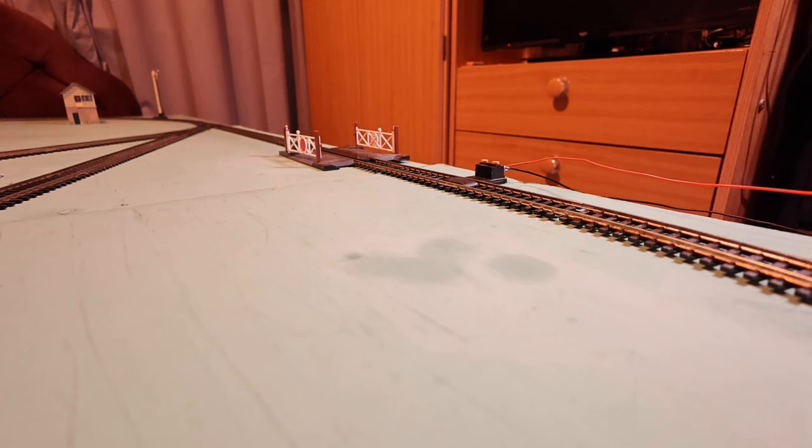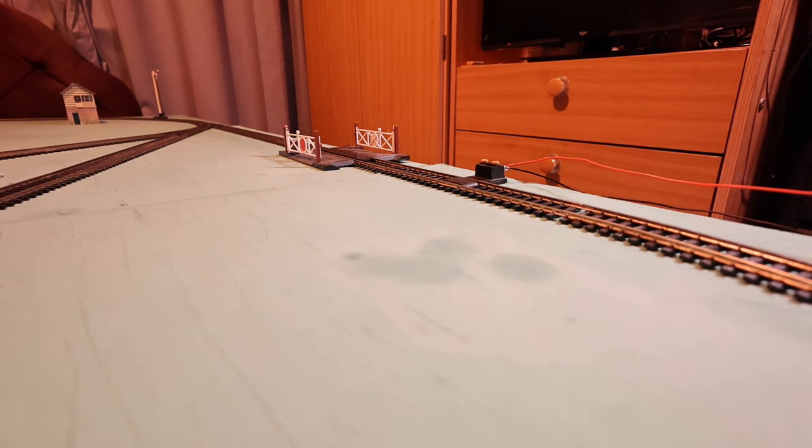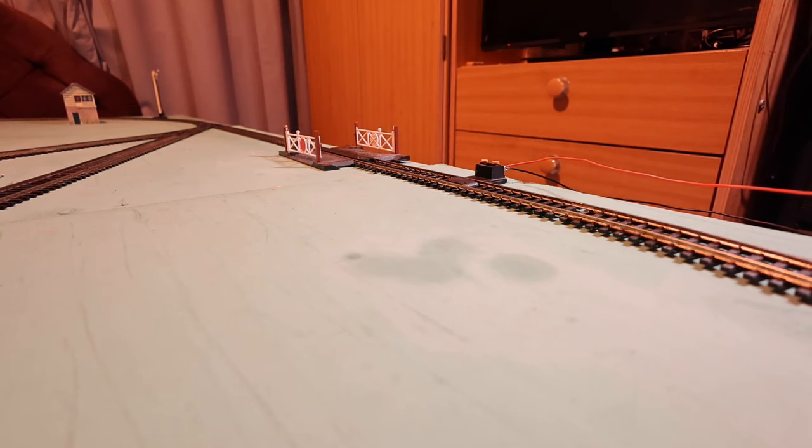Now, like I say, they probably adjusted these brackets in the factory the same way as I just did. And if you do the screw up too tight, okay, it is probably going to push, bend the bracket back up again, allowing the motor to come down too far, to allow the actual worm bar to come down too far.